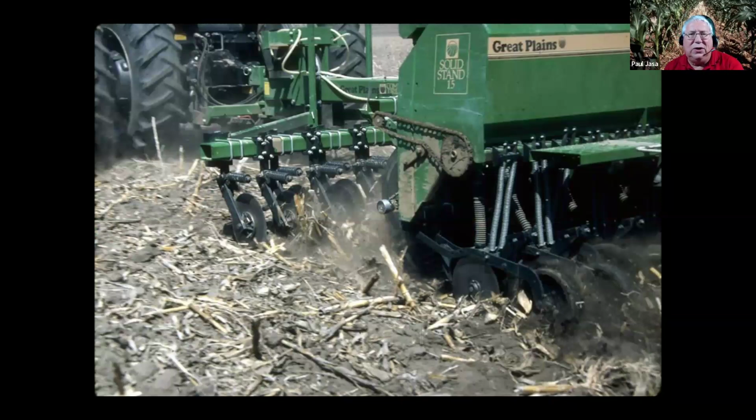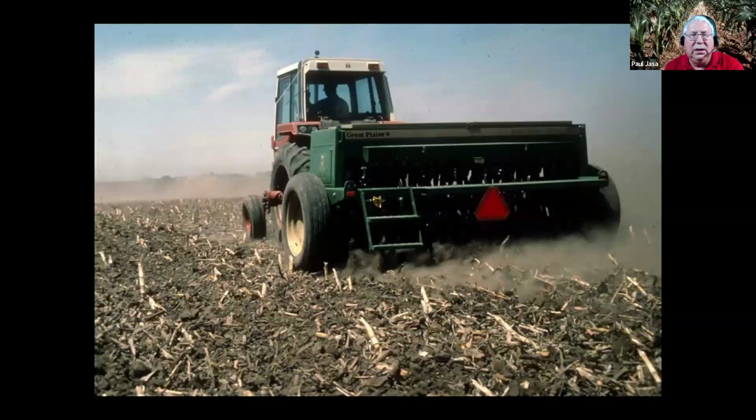If you really want to get into no-till, go to a no-till drill where it's beefed up and built to handle no-till. For instance, here is the Great Plains version that is no-till. You see a lot more residue standing behind the drill. Off to the left side of the drill, that is a one-pass system of what they call a fluffing plant with a coulter caddy drill, and it basically discs the soil. And again, that's not no-till when it comes to erosion control, moisture conservation, and so on. So again, think about how little soil disturbance you can have.